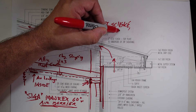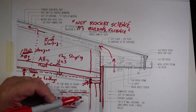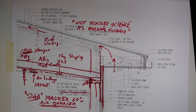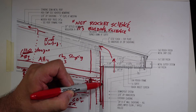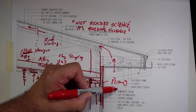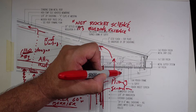Let's not overthink it. We insulate it, we net that off, we put our Myrex in, we seal it here. That framing member is part of our air barrier system. This foam is part of our secondary air barrier system. The ZIP-R9 is our primary air barrier. The foam there is our secondary air barrier. These plates are part of our air barrier system.